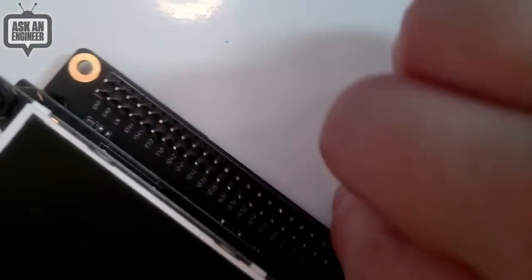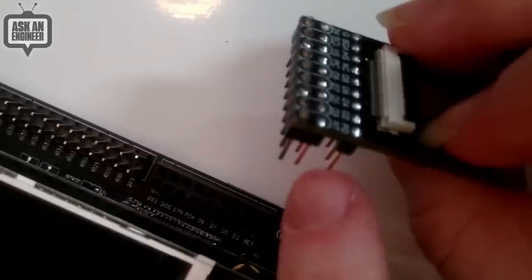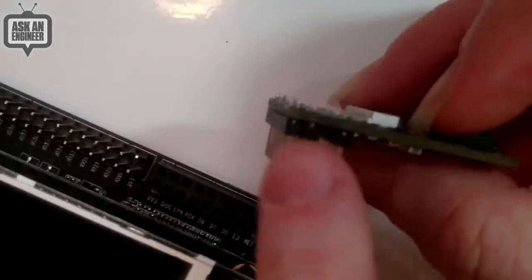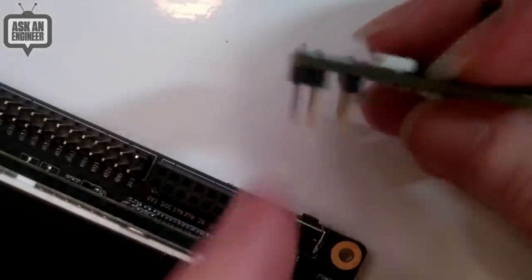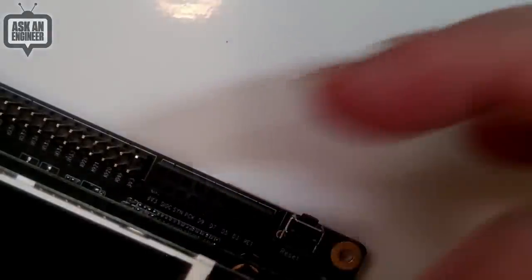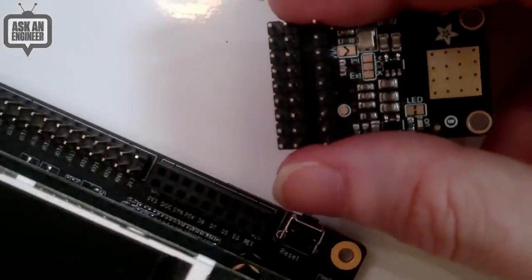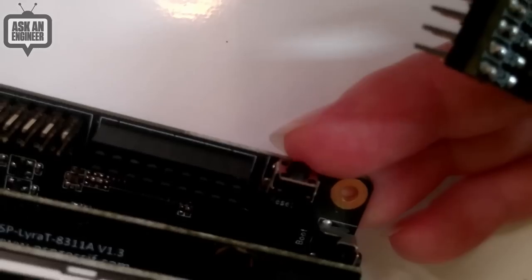And we added, in this case I soldered both pins on, another row. So if you didn't solder in the second row like I did, you could plug this into a breadboard. It's very hard to plug in dual row because you have to have some sort of divider that brings the pins apart. But it's meant to go on boards like this Kaluga, which is an ESP32 dev kit.